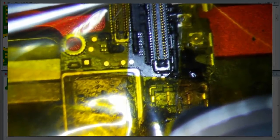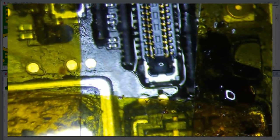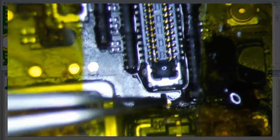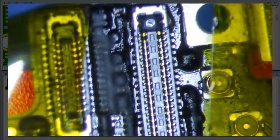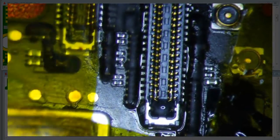I just want to get this just about straight here — straight as I can, at least. As you can see, the end joints are soldered on nicely. These ground pads are impossible to solder on by yourself with a soldering iron — they just don't stick for some reason. But when you use hot air, they stick well. I think we're pretty much in good shape here.